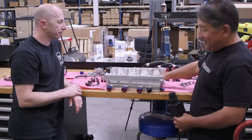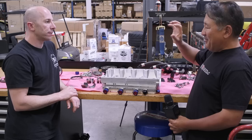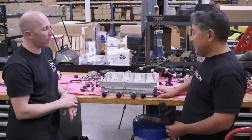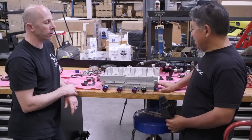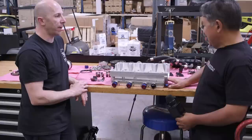The oil pan is really rigid and stiff — it was designed to tie in the bottom of the block and give it more integrity, helping resist twist and bending. The factory had a whole lower girdle called a stiffener that did that; they wanted to keep that stiffness when replacing the factory part with their custom pan. This is a billet pan — starting as a giant hunk of aluminum, machined from around 140 pounds down to a 14-pound finished pan.